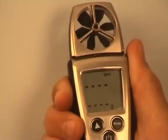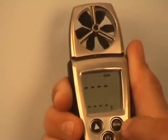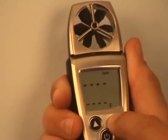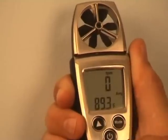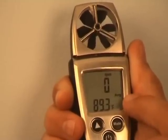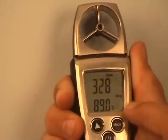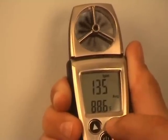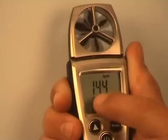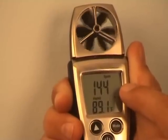You can see this is blanked out right now. I'm going to show you how to make a measurement here on the ground, then we'll go ahead and make one at the register. If we press and hold the mode key, you see it flash — it's ready to make a measurement. Release it, and you can see it says 'average.' We get a little blow here to make it work, and we have a measurement on the screen. If I press mode again, it says 'hold average,' and our average reading is 144 feet per minute.